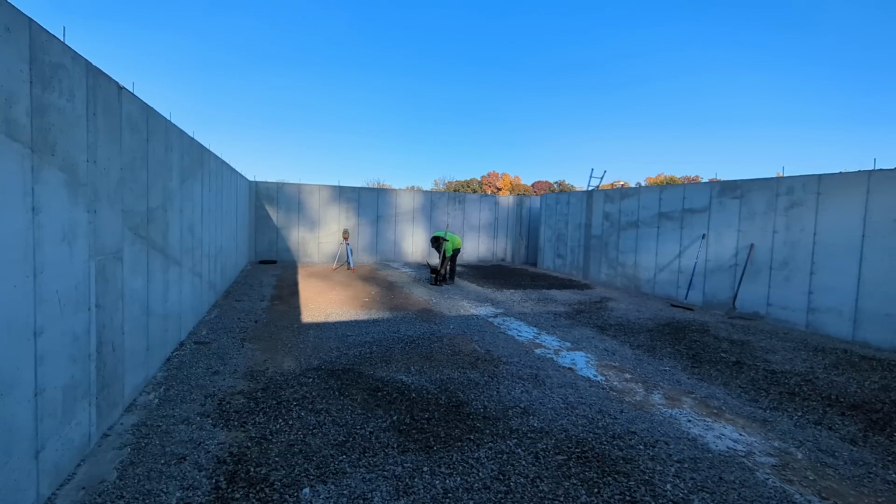And the sump pits are just to be able to have laundry tubs and somewhere to drain them to and pump the water out. So we did bump up our footings an inch when we dug them in. So we are about an inch or so low out here in the other parts of the basement. So the pea gravel is easy to work with. And like I said, it'll help that water get through because it can run right through it between the rocks under the concrete. So mainly it's just pea gravel is easier to work with is why we're using it.